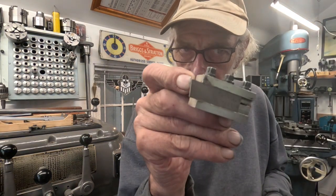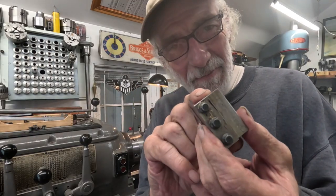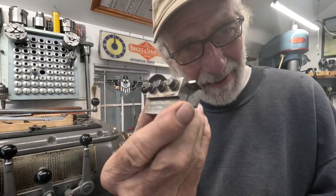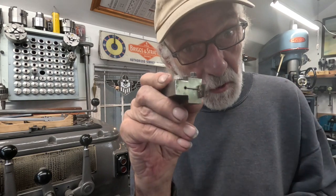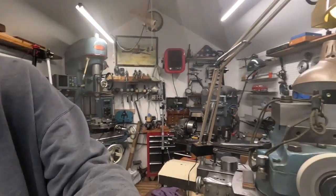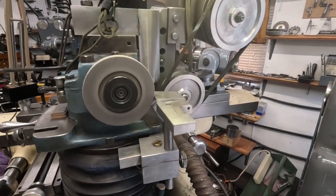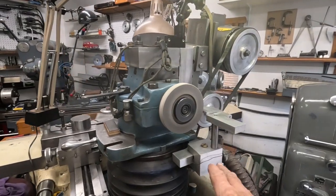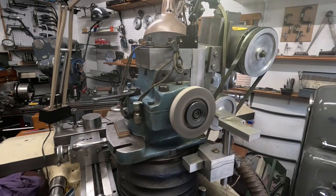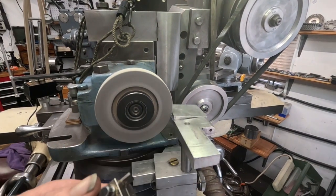This is the cut-off tool I'd like to use for my special speed-making. I made this myself years and years ago — 35 years ago or something like that. It's a handy little deal, a little high-speed blade, and I'll show you how to sharpen it. To save room and have a very versatile hand grinder on this end of the cutter grinder, I could swing this around, change wheels, and I built this rest here out of aluminum — it's nicely adjustable — so I'll have it adjusted to sharpen the cut-off tool.